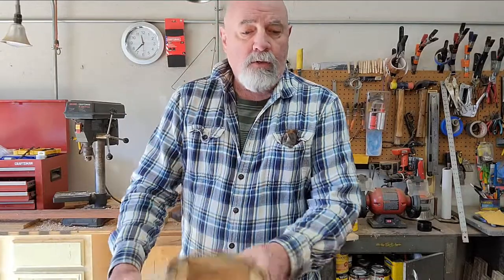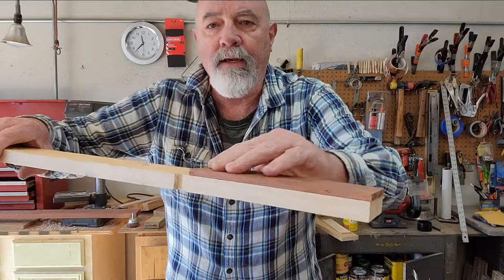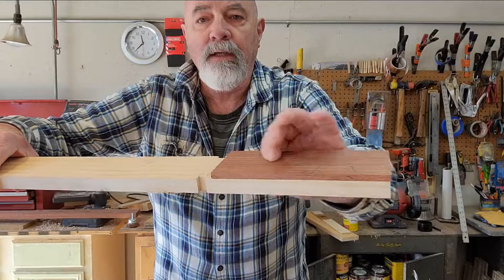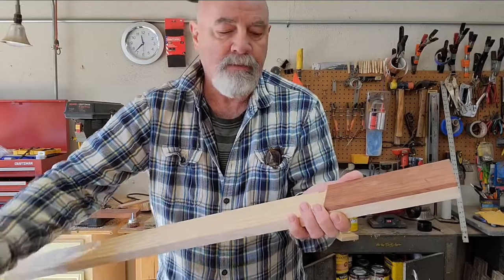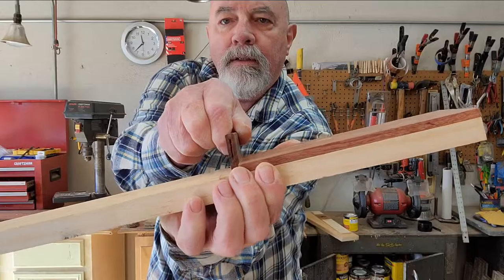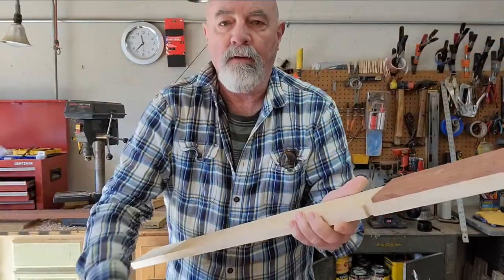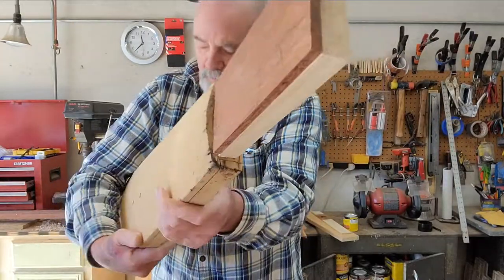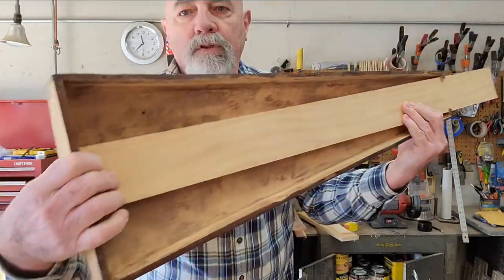The other thing I've done is create a through-the-body neck — this piece of padauk veneer over a pine neck. I'll have the holes cut up here and tuning keys put up here. There will be a little space for a nut to sit up in the top part, kind of butting up against that. I've cut some notches in here to fit. This is a pretty snug fit, so it doesn't go in easily, but it stays nicely. You've got support through the body.